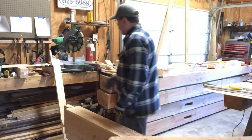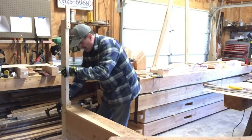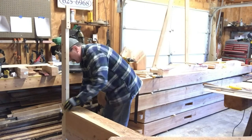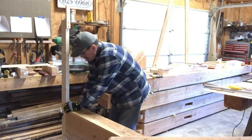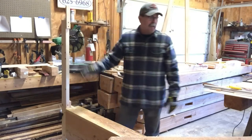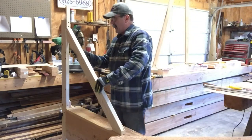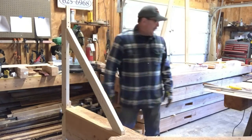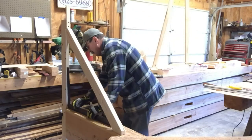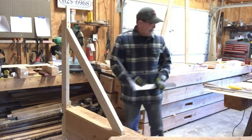So what I did first is I made a small little corner jig just to get the right distance and everything for us. So this just clamps in here. What this is doing, a couple things. There's a stopper here. So this is the tip of my knee brace. And I have just a small little gauge here, kind of show you how it's going to fit in. So I'll just check to make sure this is square. So yeah, it's looking pretty good.